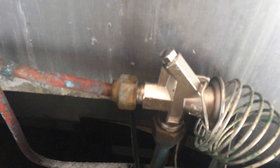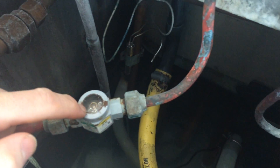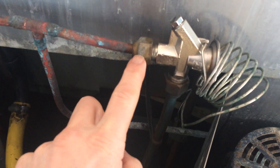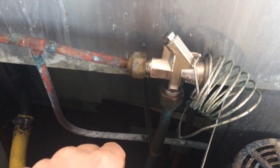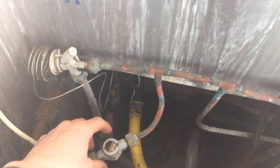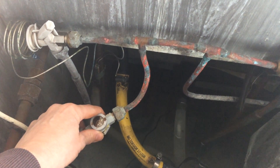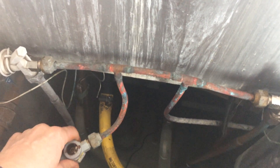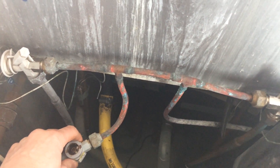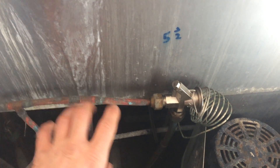What we're going to do is pump it down. If we've got a new moisture indicator, we're going to put one in because that's not telling us anything. We'll take this valve apart and see if we've got any free moisture in there, which I think we have. Then we'll put the biggest dryer on we've got on the van. It's not had any work done for years, so whether it's been running for years with moisture in there — it's not running low enough to have sucked any moisture in, so I can't see how any moisture would have got in from a leak or anything.